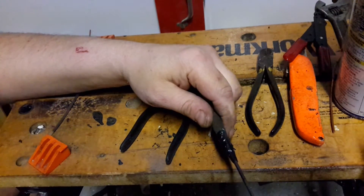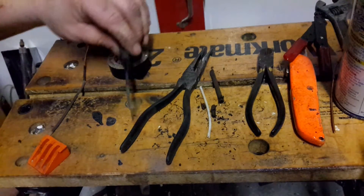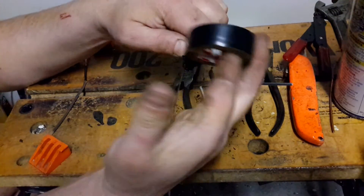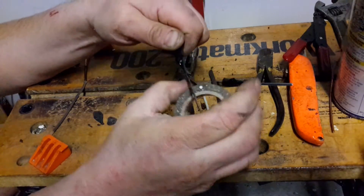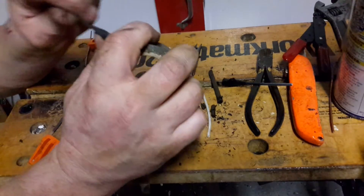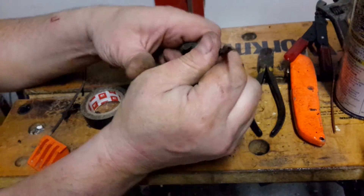Making this repair, you're kind of limited. This is better than just wrapping tape around it — getting up in there and wrapping your tape around it just to cover it up. Usually that doesn't work too well, and usually you're in limited room to work. I feel a lot more comfortable with a new piece of insulation on that old wire, and then try to tape that up with electrical tape.